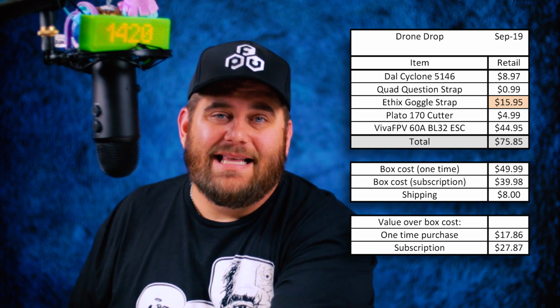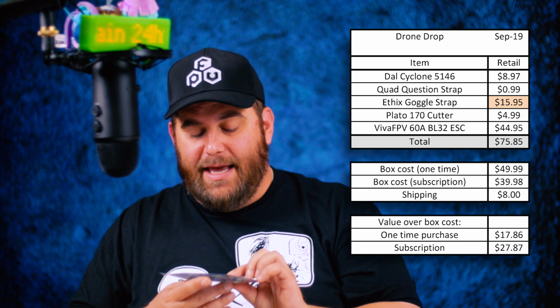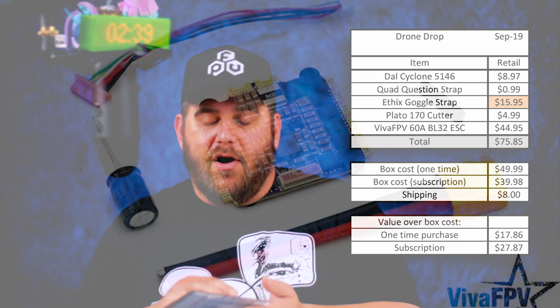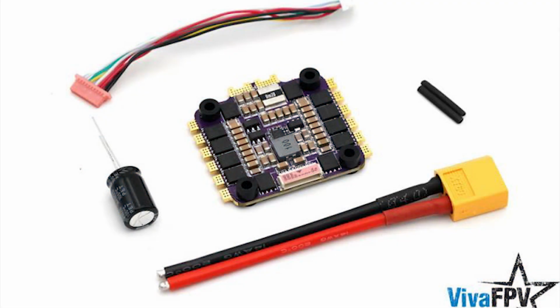And then lastly, that brings us to the Vive FPV ESC. It is a 60 amp ESC. It does come with a low ESR capacitor. I think it's only 470 microfarads though, instead of like 1,000. Usually they're 1,000. So maybe they just felt, because there are a lot of capacitors on the board itself, that you didn't need the 1,000 microfarads.